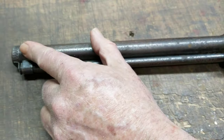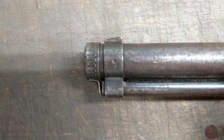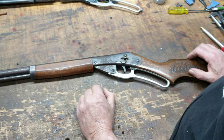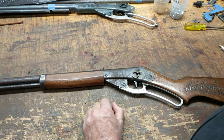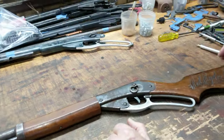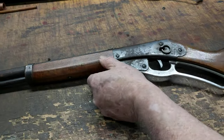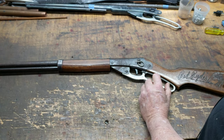The bottle cap in the gun is in excellent shape. The seam is in good shape, and the retainer spring is present, so we'll leave that there. The gun does shoot about 177 fps, so it's not in terrible, terrible shape in terms of compression. But it is gunky and junky inside — when you pull the trigger, you can hear it just go 'poof.' It's not very happy right now. So we'll take it apart, clean it up, get it happy, get it shined up and spiffed up, and on its way back to Florida so it can get ready to find a new home with the grandsons or great-grandsons of the original owner.